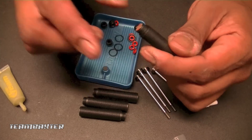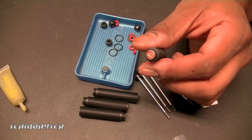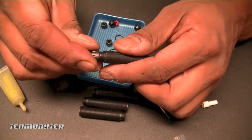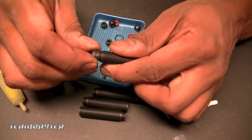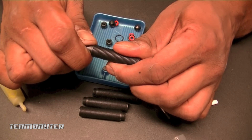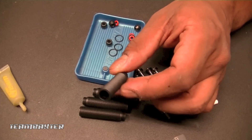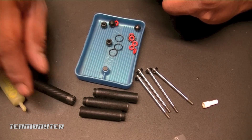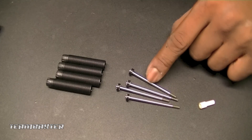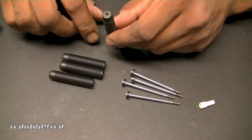It's just something I do. After I get that all in, I put the shock cap on. Make sure you don't over-tighten that or cross-thread it, being that it's all plastic — just enough. I'm gonna get that done on the other three. Shock shaft and pistons: complete. Shock bodies with O-rings: complete.